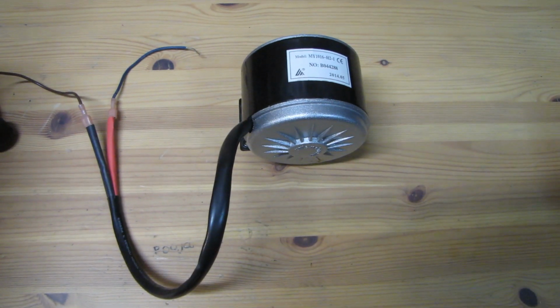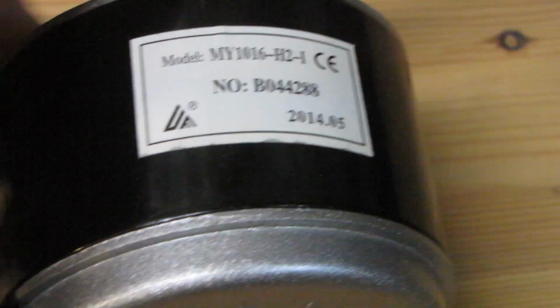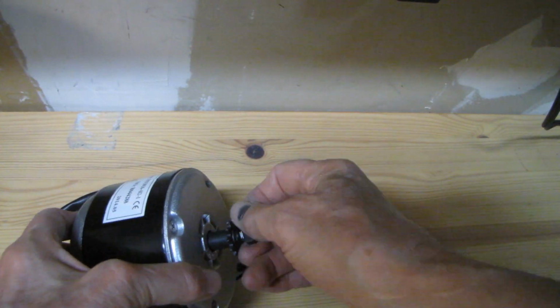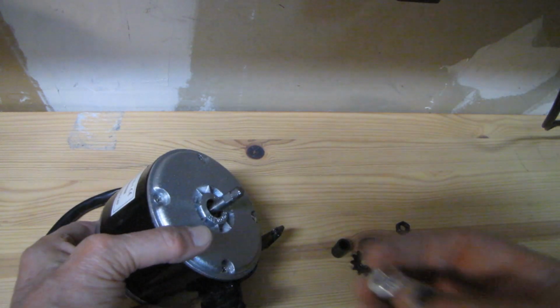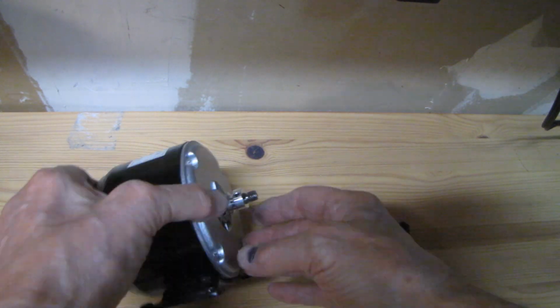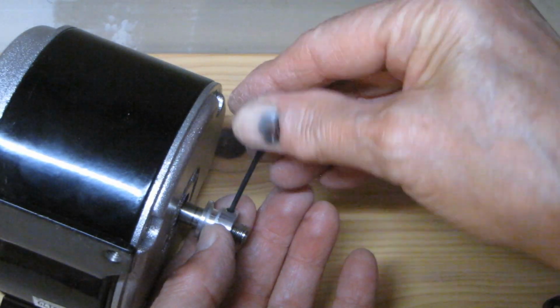I wanted to use a DC motor, which I found on the street some time ago. And I thought it's a good candidate for this project, because it has a low speed, which also could be regulated by changing the voltage of the power source. I chose the smallest pulley available on the market and put it on the motor.